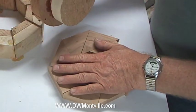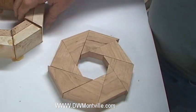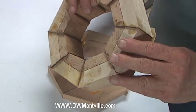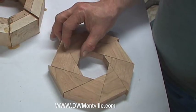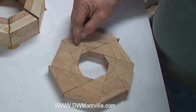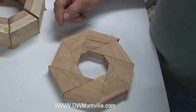And then when I have one of these surfaces true, I'll glue that surface to here, and then I'll turn that surface before I mount the ring. I still got to build another ring for what will become the top lip of this bowl. And I just wanted to show you the little detail about how to carefully keep track of your grain orientation when you're doing a segmented layout, because anytime you get the opportunity to avoid end grain on the edge, you take that opportunity. Thank you.